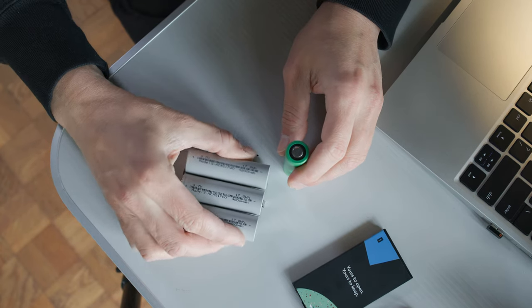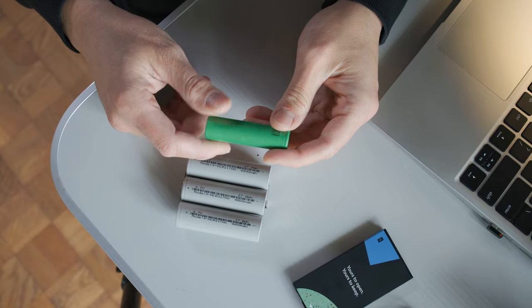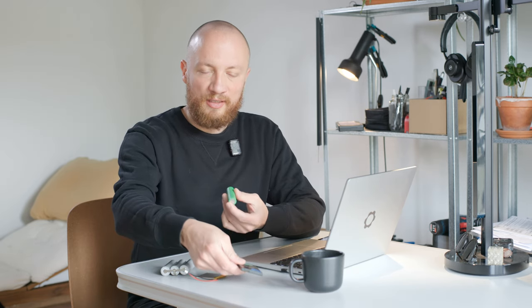So it's going to be cylindrical cells. These are actually from a Tesla Model 3 battery pack, and this is just a random 18650 I had lying around. The best choice here is cylindrical cells, mainly because there is a ridiculous amount of variety to choose from and they are available all over the world for very reasonable prices. Due to their shape they don't fill out the available volume as well as a prismatic would, but overall they tend to be a bit more energy-dense, so I think they are still a better choice. Size-wise, this here is an 18650 which is a very common size, and four of these next to each other will fit nicely in the 10 by 10 footprint of a CubeSat.